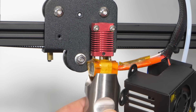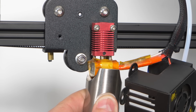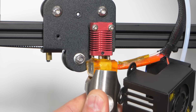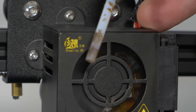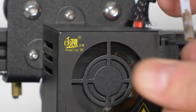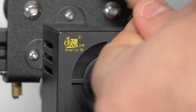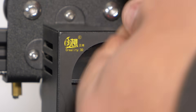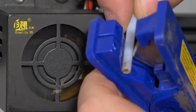Once cleared, simply screw the nozzle back in while the heat block is cold, then hot tighten it by heating the nozzle to the highest temperature it can go and tighten it once more. If you have a MK10 hotend, it would be ideal at this time to also cut a small piece away from the PTFE tube that goes into the hotend if it is damaged, blocked, or looks burned. Make sure it is perfectly flush — having a PTFE tube cutter can come in very handy as it ensures a perfect perpendicular cut. Once done, simply reassemble.